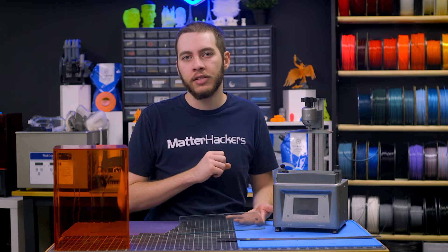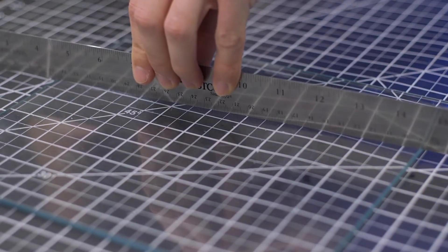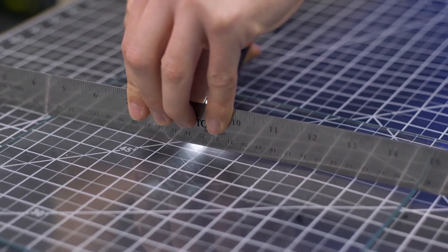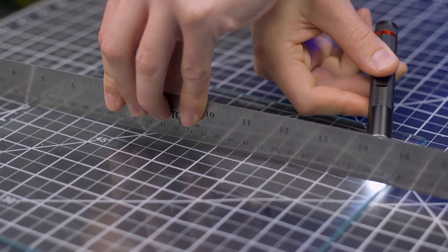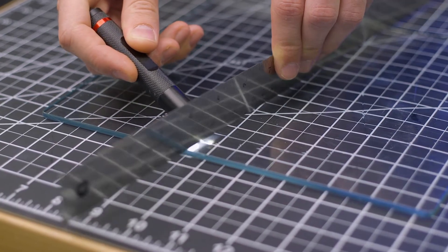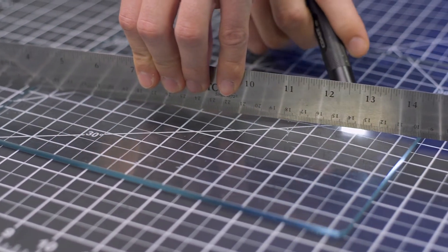While a surface plate made of granite is one of the flattest pieces of equipment anyone could find, most will not have access to one. Instead, take a metal straight edge and lay the side across the surface you want to test for flatness. Shine a flashlight from behind and toward the bottom edge, looking for any spots where light peeks out from underneath. If you can't see the light at all, great — this is a fantastic surface that is as flat as we need. Be sure to rotate the ruler a couple of times to make sure the entire surface is flat, not just that specific spot.